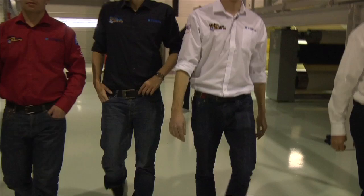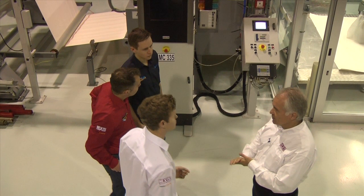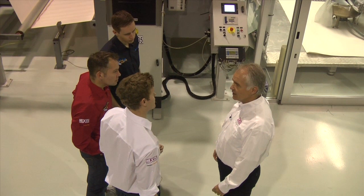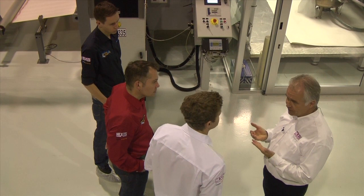This building is where we make the cast vinyl. This is our casting line, where we make the vinyl film from liquefied PVC. The liquid PVC is cast, as the name says, on a casting sheet. And then it goes through a long tunnel where we extract the solvents in the vinyl. The film is dried and we end up with the PVC film.